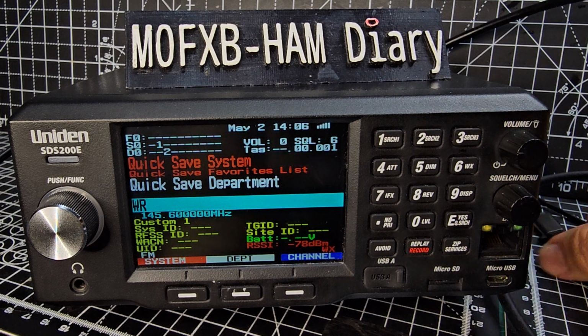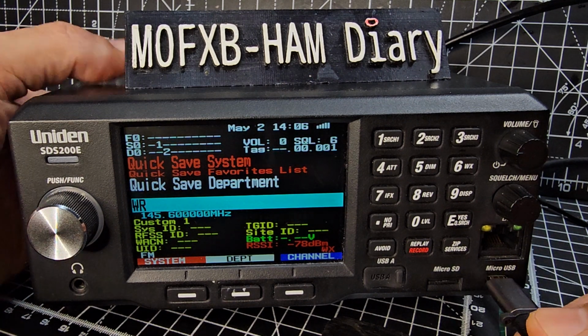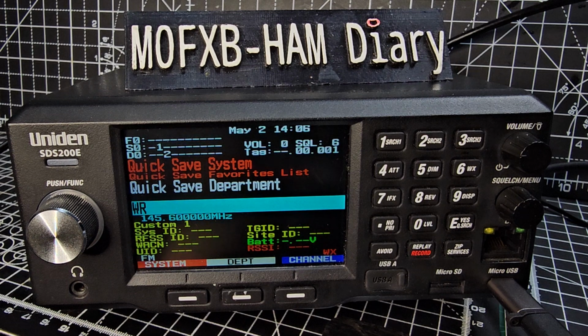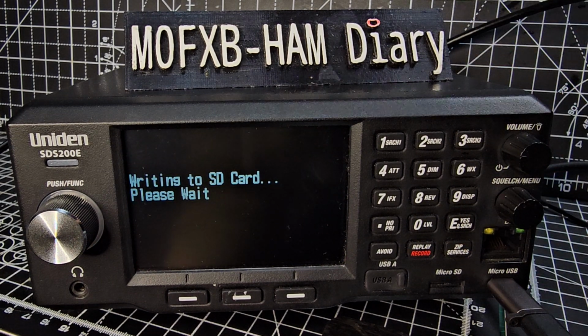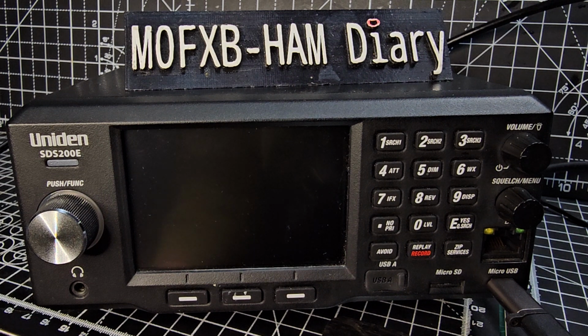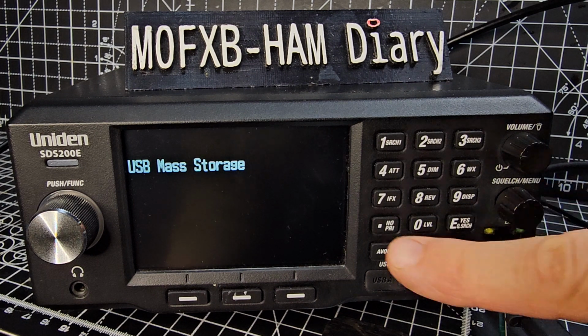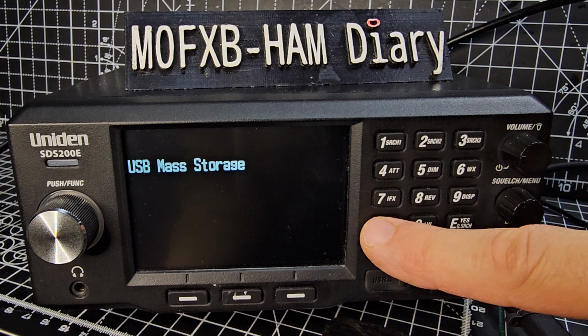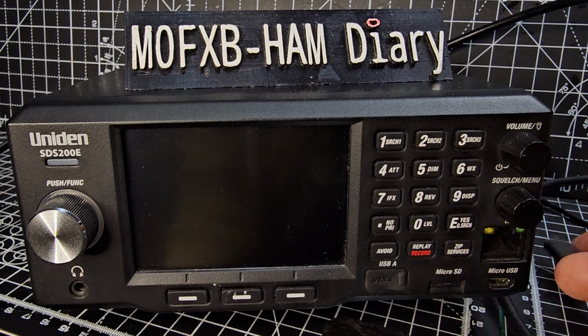And when you enter your USB lead here, micro USB to the front, you'll get an option at the front to press the E button. When you press E, effectively, your PC with the software, Sentinel, ARC, Butel, and ProScan, things like that, is reading your SD card without you having to remove it, which is very handy. Otherwise, you press the no button. You've got yes here, and the dot is a no, and then you can come out of that or just unplug your USB for now.